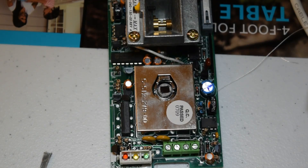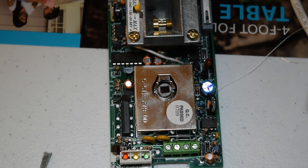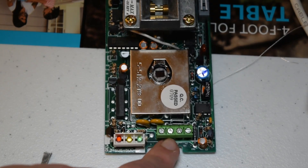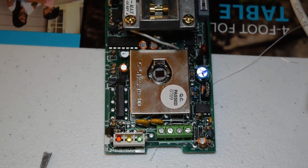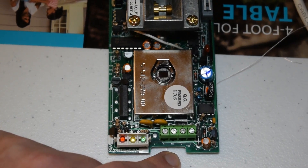First, in terms of the wiring, we're going to start with the motion sensor. This is what the motion sensor looks like without its cover on — it's got its own circuit board and terminals. Most auxiliary devices tend to have their own circuit boards and terminals. The two left-hand terminals say common and normally closed, so with this one it has to be normally closed. On other auxiliary devices I've seen, there are terminals that say normally open too, so you do have a choice.